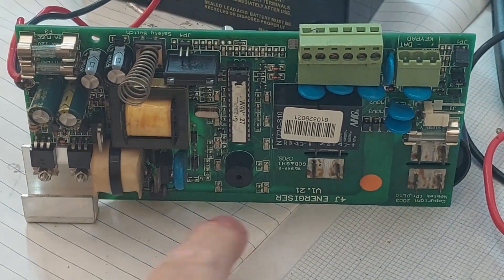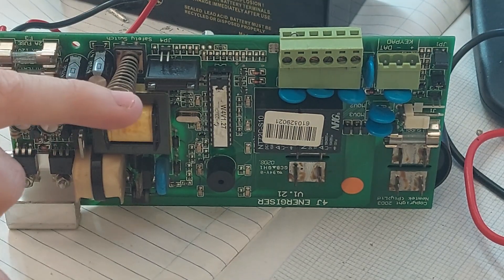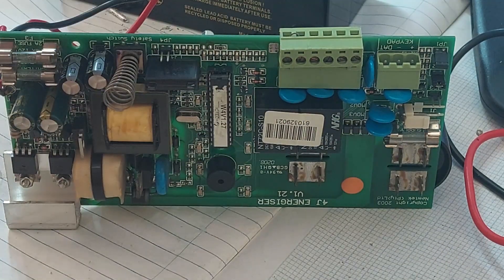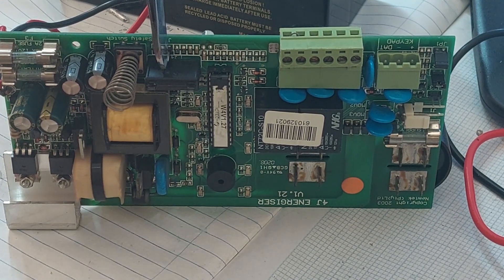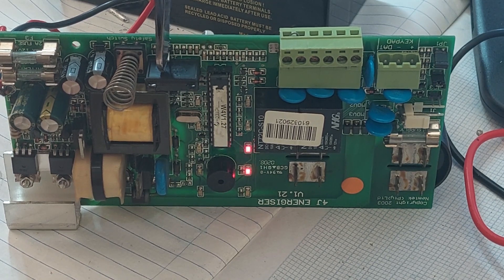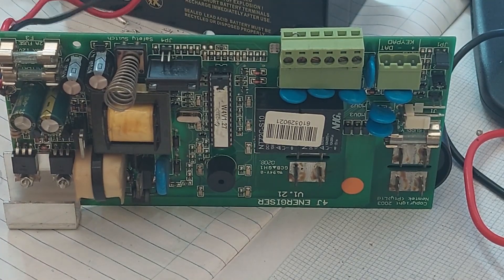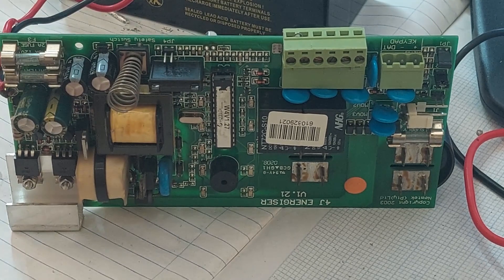We won't get that mains power-on light because we don't have mains connected, and there's also a safety switch here that stops it from operating when the cover is open. You can push it in or just use the bypass jumper. When we short out the bypass switch it should come to life. Okay, that's more life than we had when it was downstairs. I think those capacitors were the problem — just those bulging caps. We're going to go back downstairs, put it in, cross our thumbs and hope for the best.